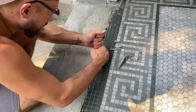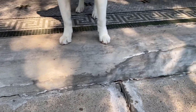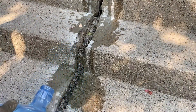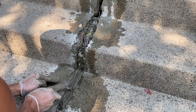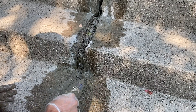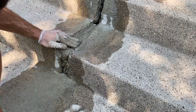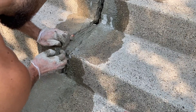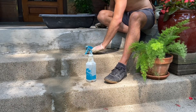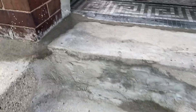I knocked out and knocked in all of the crumbling, loose, and cracked areas to give me space to push in new concrete mixture. Once I finished, I made a very loose concrete mix and started filling in the cracked spaces. This is not meant to last forever — it's just giving us a little bit of time before we can actually replace the entire step. The mixture is extremely wet so it can establish itself and give me some working time, and then if you sweep it off it gives it a little texture to accommodate the much-repaired steps.